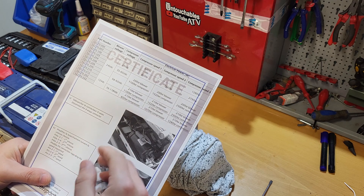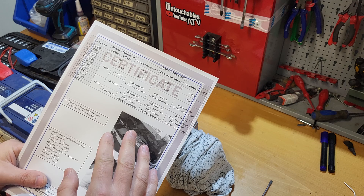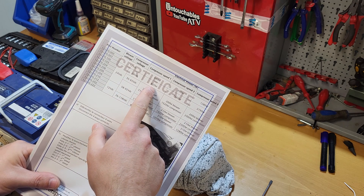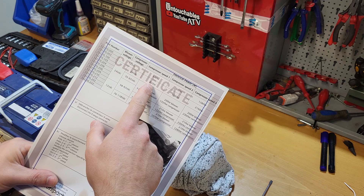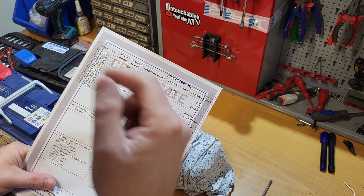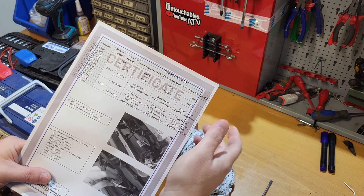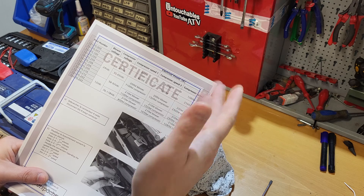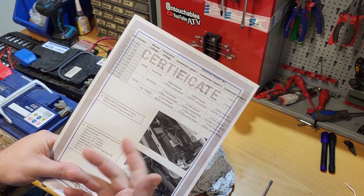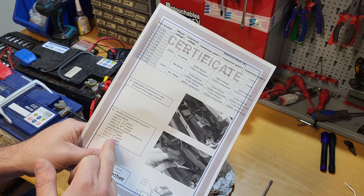So this is a 24V DC compressor. First speed is 820W, second is 1500W, and third is roughly 2000W, depending on the speed selected. And we have here how to configure the speeds.